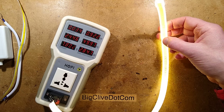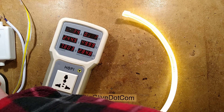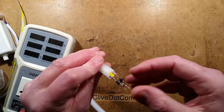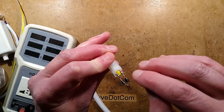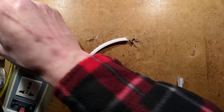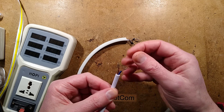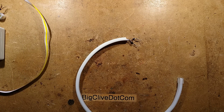You can see the outline of all the LEDs on the back, but a very diffused line on the front. I heard it popping and crackling — that's my wiggly connections. Things worthy of note: if you look down the end of this with a magnifying glass or good eyes, you can actually see a little plus and minus symbol on either side, so you know the polarity. It's interesting that the end termination had blue as positive and brown as negative. This is also copper-coated aluminium wire — I gave it the flame test and it just went all limp and crumbly and burst into flames. Not really keeping with quality.